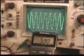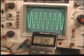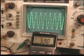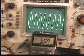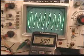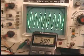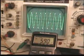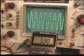Okay, now I've got the 18 volts connected to the amplifier, and I have set the bias resistor so I have a nice signal at the output of the collector, and I measured the resistance of each, and R2 is 14K and R3 is 34K.